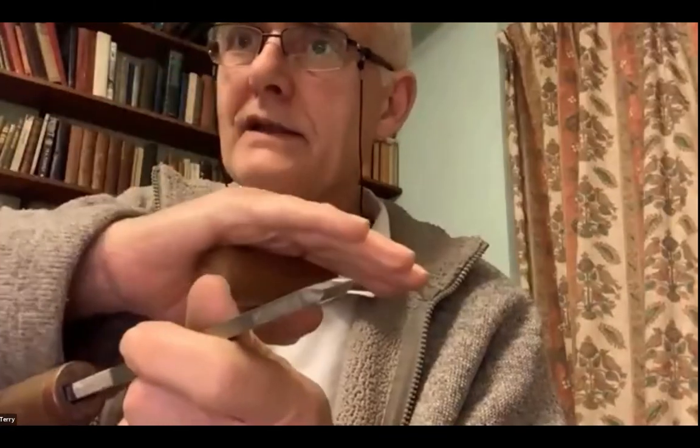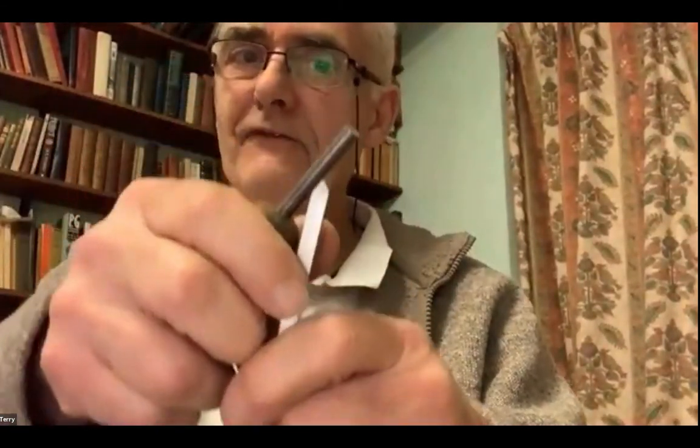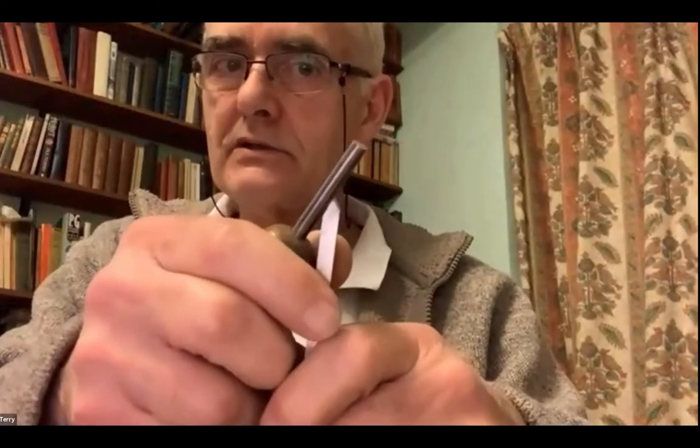What you do is get rid of the top. This is the top, right? If it's got a burr, you either take it off with a diamond card, or you can use the felt wheel, or you can use your burnisher. Lay it flat on the bevel and just go across a couple of times just to press down the burr that's left by the grinder. Then, on an ordinary scrape, it will be the top surface.